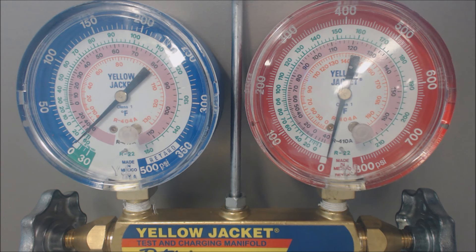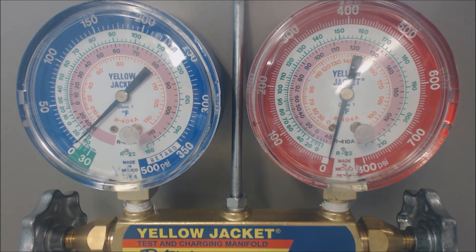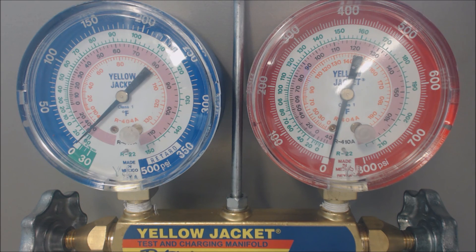If this is the complaint from the building manager or homeowner, check the easy stuff first. After you do those things and try adding refrigerant and that's not the issue, then start taking a look at that TXV. Just make sure you defrost the evaporator coil before you do any of this. Hope that helped — we'll see you next time at AC Service Tech channel.